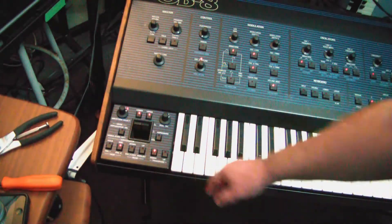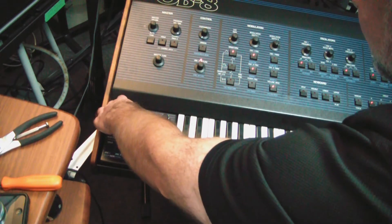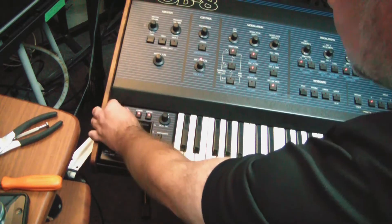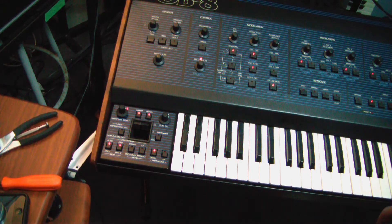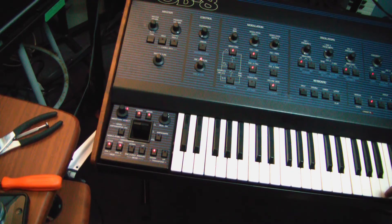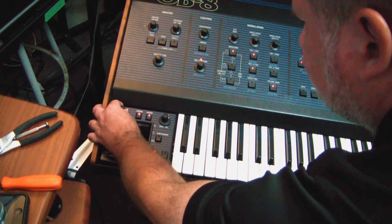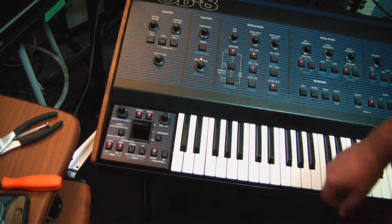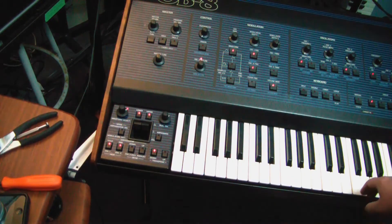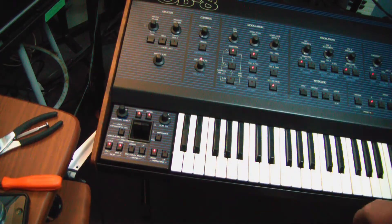The rate knob here for this LFO over on the left-hand controller — that's for vibrato, set on oscillator two only right now. If I pull this up it switches the wave shape, and at the moment we switch it to square. Hopefully you can hear that clicking, and if we change the rate we'll hear the clicking change with it. But the only way we should be hearing anything from that LFO is if we move the lever, or if we pull this one up to set it permanently. With everything the way it is, we shouldn't hear any effect at all, but we hear this clicking.